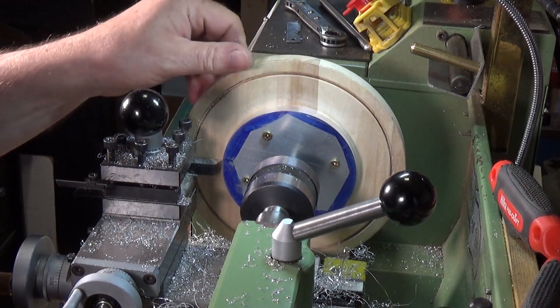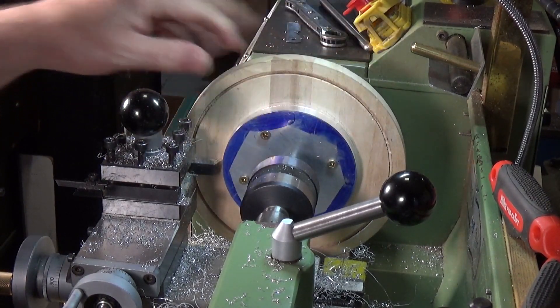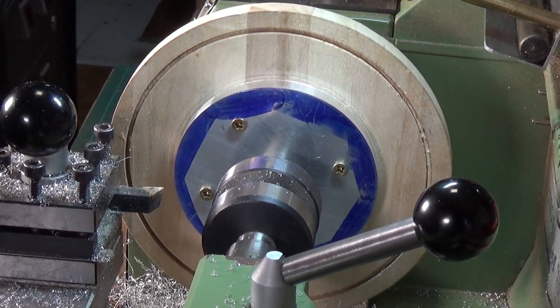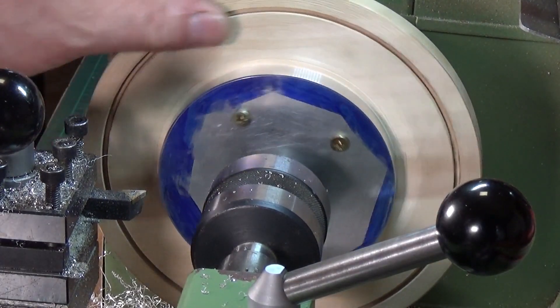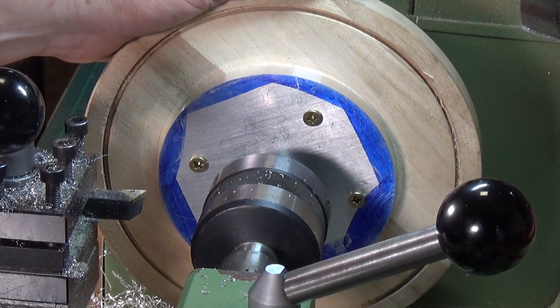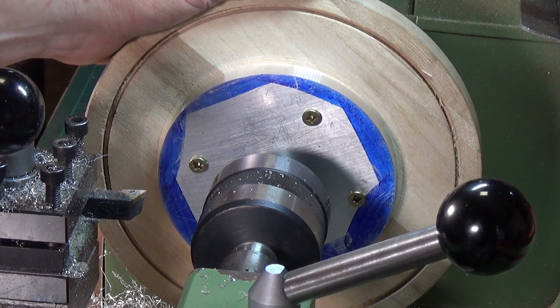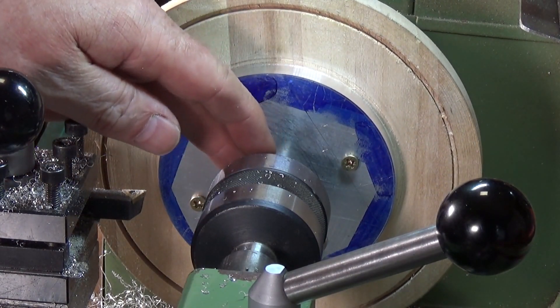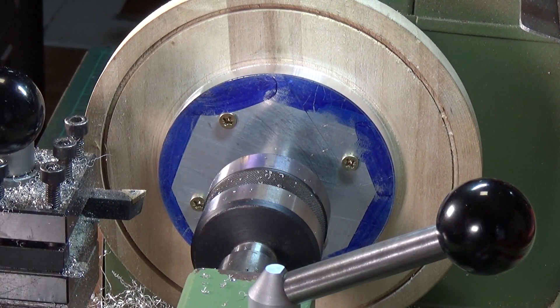Pretty much it — not bad at all. There's our disc, just come out quite nicely. The next job will be to remove it and hopefully hold it in a proper chuck or put a mandrel on it. I need to bore a hole in the middle to put a bush in there as a press fit, so I've got the ability to lock it onto a shaft. The wooden faceplate idea has worked out superbly in this case.